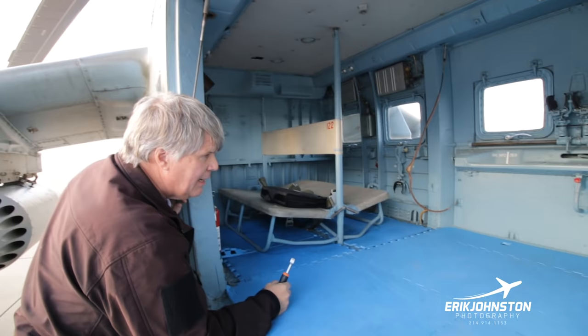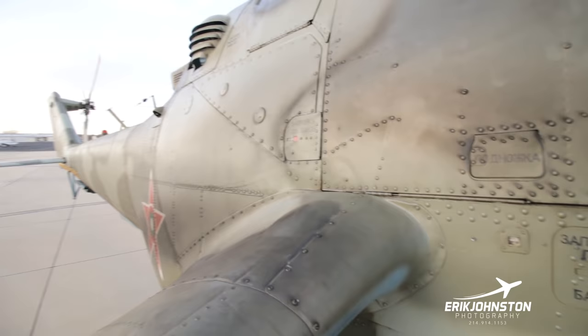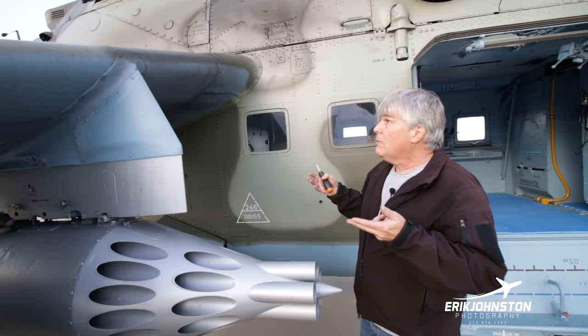So when we're fueling the aircraft, we normally fuel it above the right wing. There's a fuel compartment right up here, and that will fall through three into four. We open the interconnect, so when we're filling it up through three to four, four and five get filled up, and then it backs up into three. And like I said, if we've used up fuel out of tanks one and two, then we've got a little bit of a void. We're not going to quite be able to get 2150 liters.